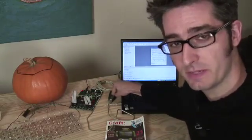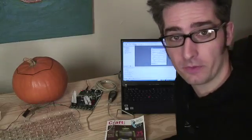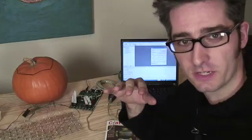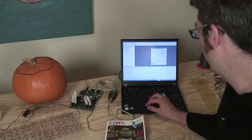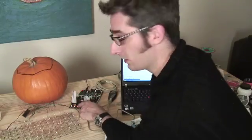The most intimidating part of this whole project was actually programming the microcontroller. This is made pretty easy with the STK500, which is about $80 — this little board right here. You plug it in and attach it with a USB to serial converter, then load up the software on your PC. Make sure to upgrade the firmware, because otherwise you spend about three hours becoming very frustrated. Once you've done that, it's actually quite easy. You upload the programs you download off the website, go up to Build, click Build, and it takes the program and turns it into a hex file, which is a computer language. Then you press the AVR button, which connects it to the actual machine, search for the hex file, and click Program. It starts making a little blue progress bar go across and programs the chip. You know you're doing something right when the little LEDs flash.